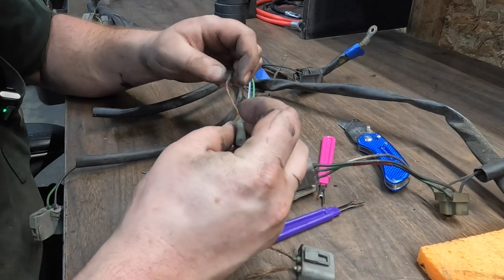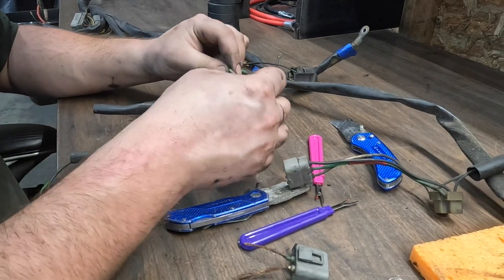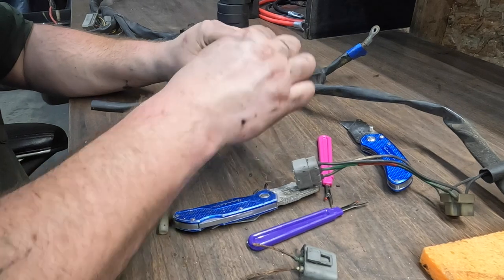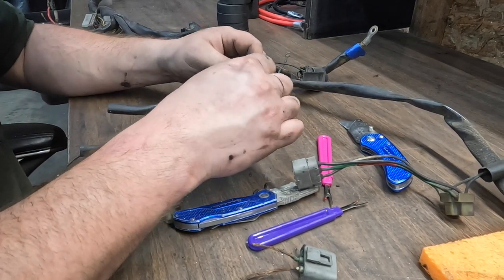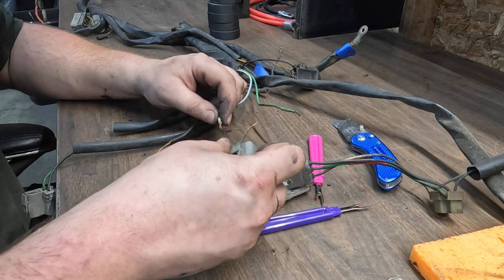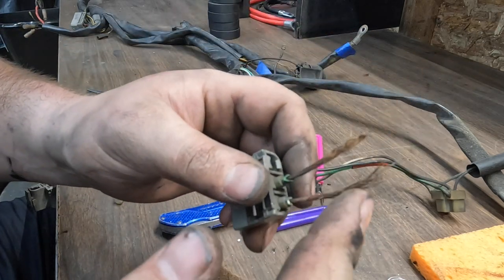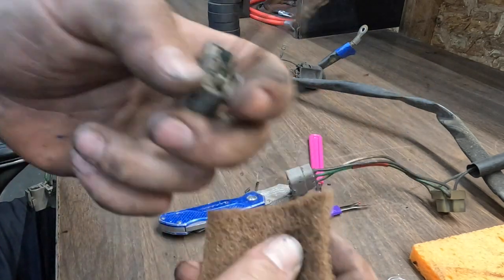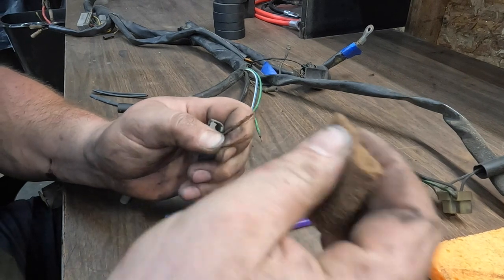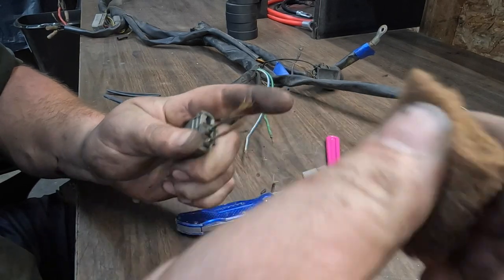Here I can see there's actually no strands broken. This is probably just a result of either ozone, UV, or some kind of damage that ate away at the insulation on the exposed part, because everything else is still in nice shape — that insulation is still nice and flexible. So this guy can just be fixed with some heat shrink, but obviously these two fellas are going to need spliced. These exposed wires are quite gross and oxidized and dirty, and those aren't going to take solder, so to clean them up, you just want to take some sandpaper or coarse Scotch-Brite to get back down to bare copper, and then that'll let you tin them so you can solder.